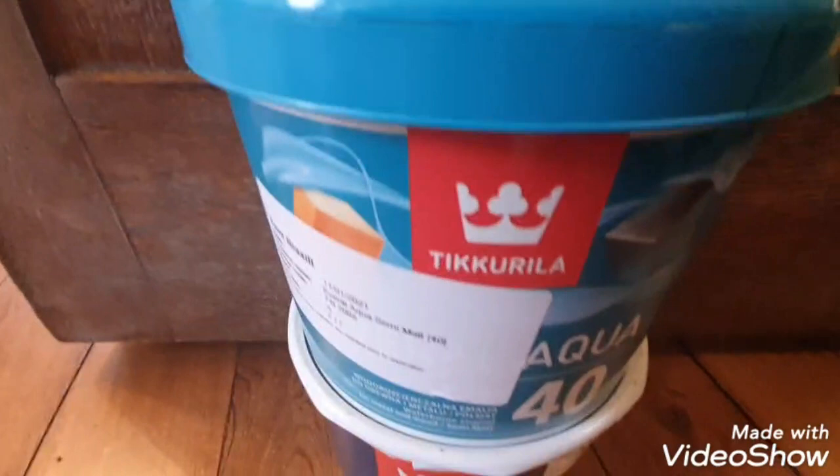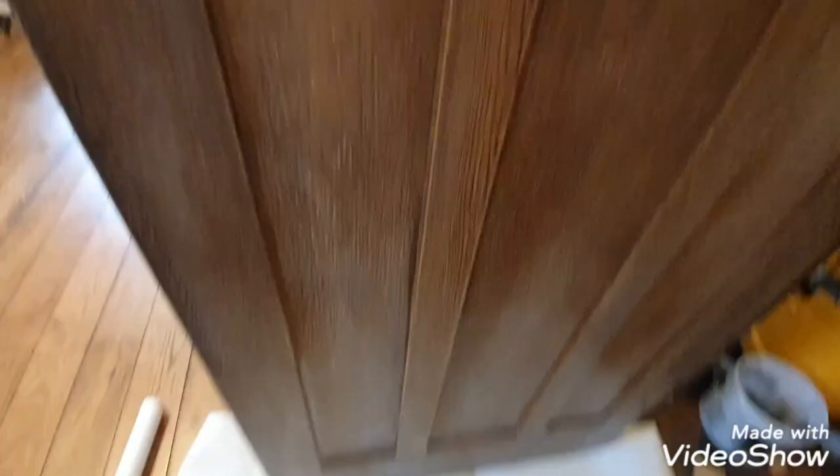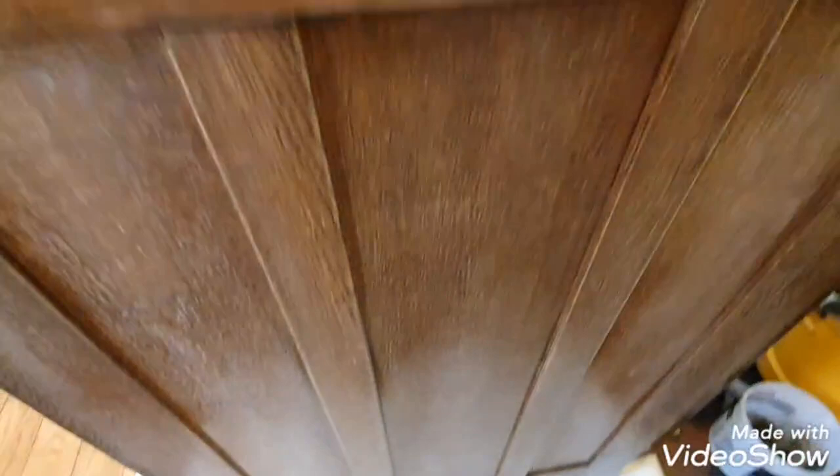All white I think - all white, so yeah, be nice to see how it all turns out. Right, so I've taken everything off now, all the furniture. But before I do this door I just want to show you the preparation. I've got a wedge here - it's quite high underneath. We always carry a little block of wood and a wedge in my pocket, and put lining paper down because you can just dispose of it afterwards - it soaks up paint. It's the easiest thing to slide under any door, so always keep a roll of lining paper.